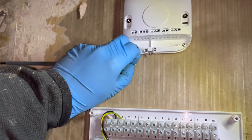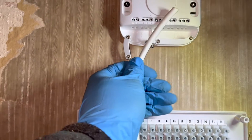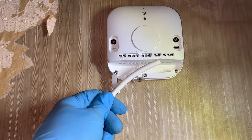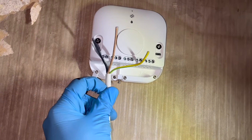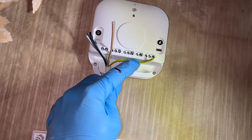If it does look a bit messy outside the wiring centre, that's why. In terms of knowing how much cable to strip off, what I'll do is measure the furthest cable - you can see if I put the cable here, the furthest one is going to be the earth - and then I can cut down the other cables accordingly.